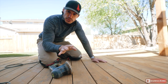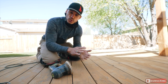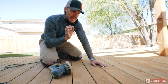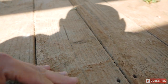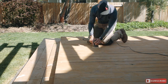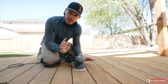So this is the first time I've used the deck stripper from Behr. It worked okay — the instructions said put a liberal amount, keep it moist, and between 15 and 45 minutes start using a pressure washer holding the nozzle at least 24 inches from the surface to wash off the previous stain. I didn't see a lot of material moving at first, so I brought the nozzle a lot closer — it worked way better, but after pressurizing the raw wood that close, it left a little fuzzy filament. I know that'll be a problem with the new stain, so I'm taking my sander set on rotary mode with 80 grit to smooth it out. If you don't have a fancy sander, you can use an angle grinder with an 80-grit sanding pad attachment and do the same thing.